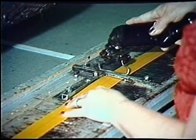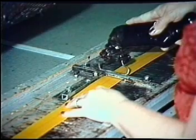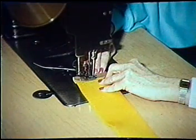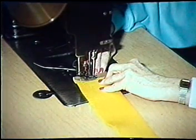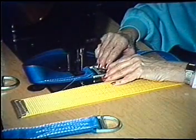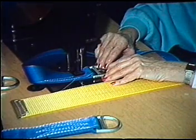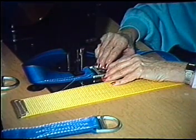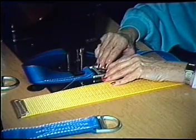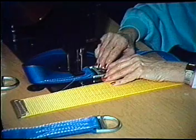Heavy-duty nylon webbing is cut to length from 100-yard rolls with a hot knife to prevent unraveling of the webbing. The pad, after having end pieces sewn on, is then attached to the 1 3/4-inch nylon webbing. At this time, the D-rings are stitched into the belt using a special reinforcing strip. The friction buckle is then stitched onto the back and waist straps. When completed, this gives wraparound protection.